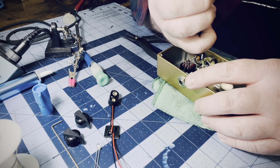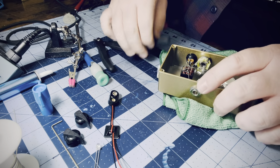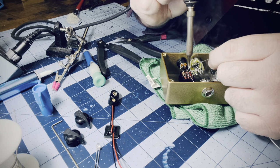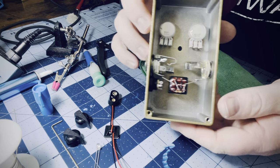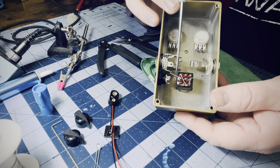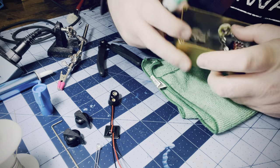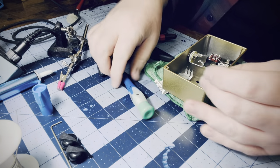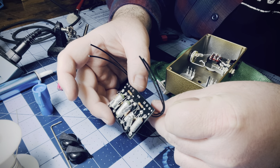This has a little bit extra down here, so I'll cut that off and cut this excess off. I've got a tight gap in here so I've got to make sure I don't melt the power jack. You can see those two bus wires here and here. So when the signal comes in, it just goes through that. If it's in bypass, it'll go up through this zero ohm resistor and then straight back up — pretty short. It's ready to put the circuit in now. I need the LED. We'll do the battery snap last.